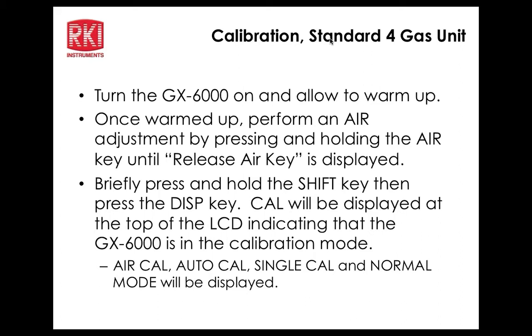Performing an air calibration: press power/enter, press the air key, and adjust zero. For auto CAL, a submenu appears with concentration, gas select, and escape options. Moving to concentration shows the calibration gas values to match your cylinder. You can change any individual gas value — for example, setting methane to 50% LEL — then confirm each one.